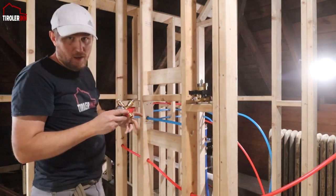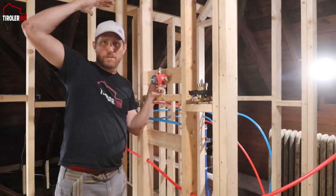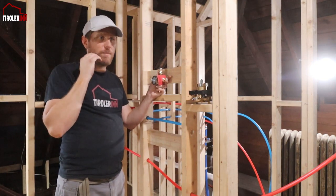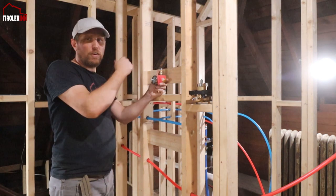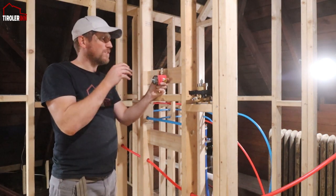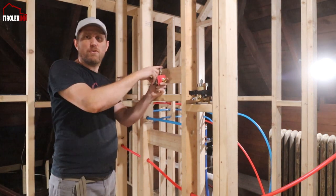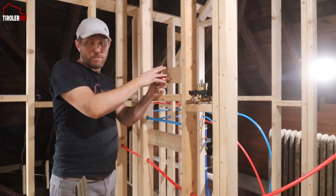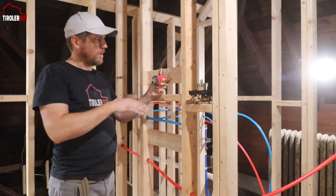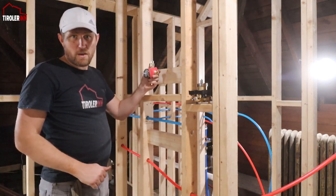Why do we have a multifunction tool here? What we want to do is have a rainfall shower from the top, and we want to have a handheld device also at the same time. So the handheld device, we don't want to have that always on. We just want to have that on sometimes. So we will have the rainfall shower going up straight, so it's going to position number two, or position number three, and then position number one is going to be just the handheld device. And then position two would be both at the same time. So that's what we have to install.